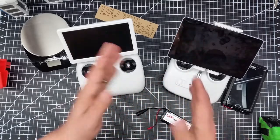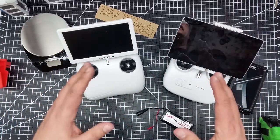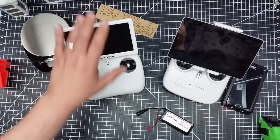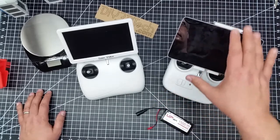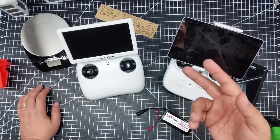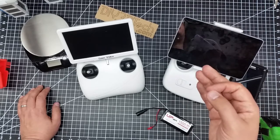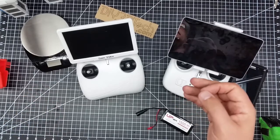So that's really an important feature because this is where these are really two different beasts. I really can't say outside of the size that you can really compare these. This is more your classic quadcopter drone. This is more of a photographic platform because one of the other pieces, so for general quadcopter use, there's two frequency bands open and they're both for Wi-Fi. One is 2.4 gig and the other is 5.8 gig. Now 5.8 is not very crowded, where 2.4 is extremely crowded and being lower is also very noisy.